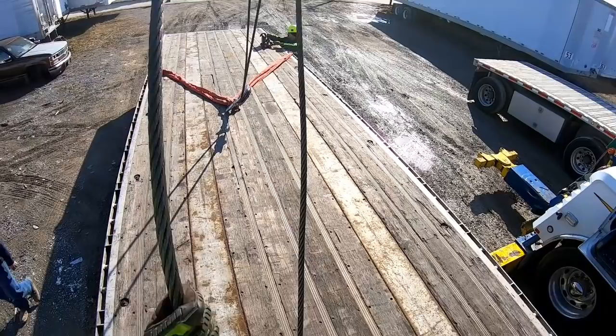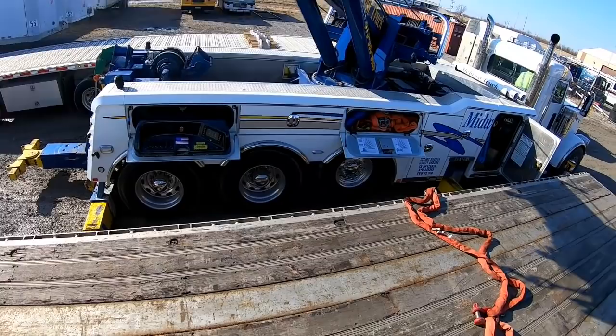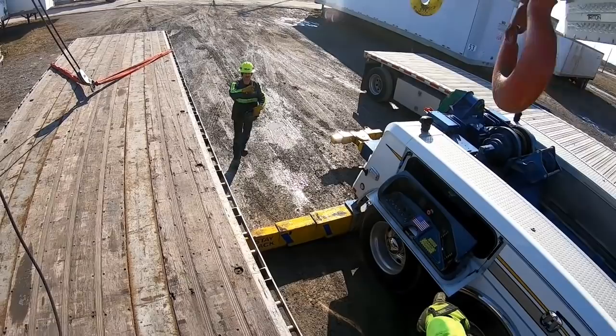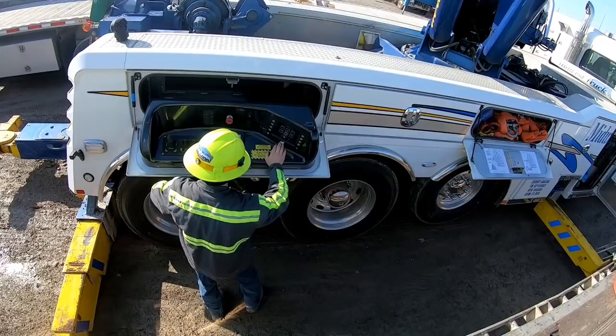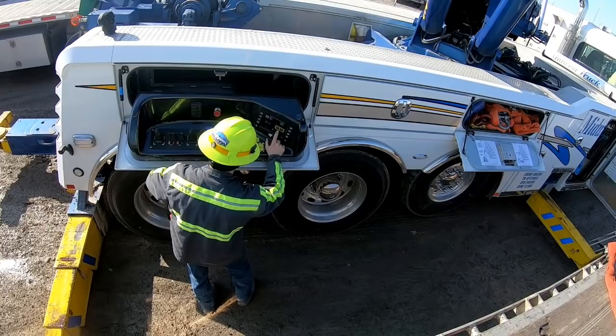Yep. Rotate me around a little bit. Now, you'll want to rotate. You have to release it up here first before you can roll. Go to your winch free spool screen. I got them all free spool. Okay, all right. Then go to your winch speed. Your house lock is already unlocked. Hit the travel lock right beside it. There you go. Yep, and that's your forward and back.